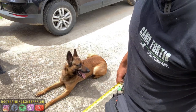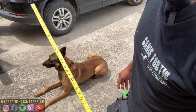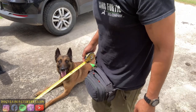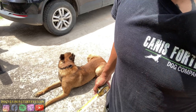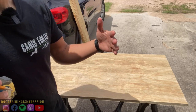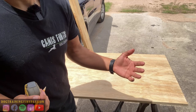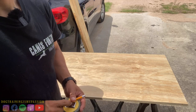I am pretty much customizing this. The dog is the largest we have, so I'm going to lay them down and measure roughly the length of that position box — that's roughly about 41 inches. I'm going to make adjustments for the front part as well. So what I'm going to do is measure 16 by 41: that's 13 inches for the width of the body plus three inches to allow for the two by sixes, plus the length of the body which is roughly 41 inches.